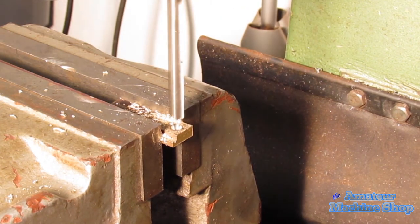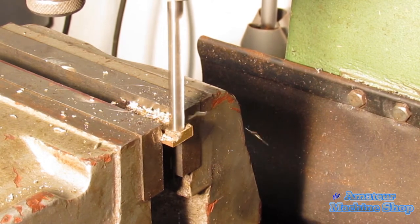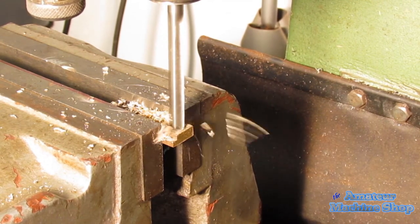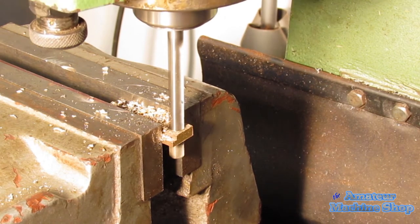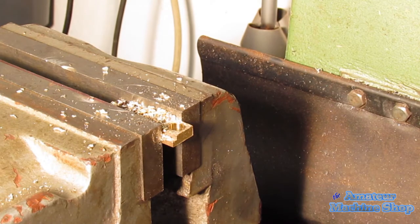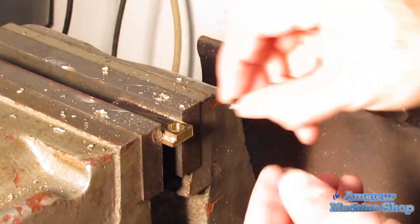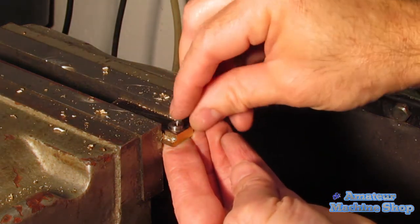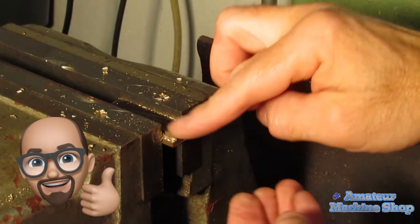The 8mm hole is for a small bearing. I debated if the hole should be bored or reamed, but I have neither of these tools available at home. A drill bit generally cuts a little oversized at the start and as it feeds down, cuts closer to the nominal size of the drill. After the hole is drilled through, I check the fit of the bearing and it drops in a little and snugs up against the bore as it's pressed down. Perfect.